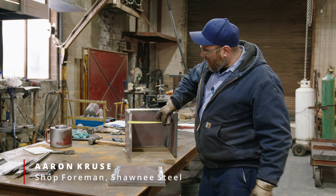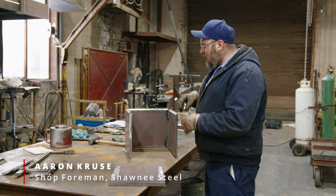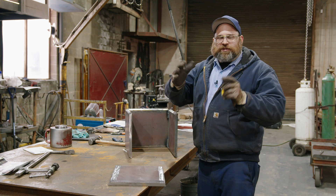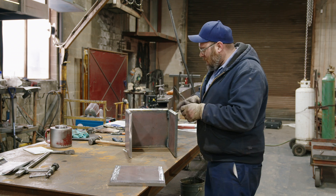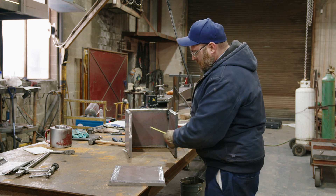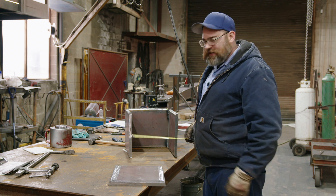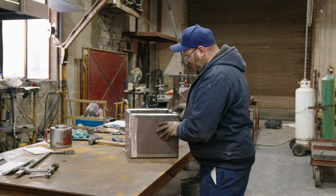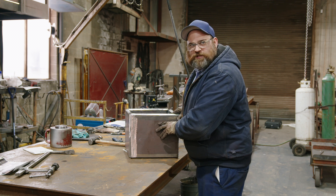What I have here is some three-quarter plate — it's a box. I've welded it down and it has shrunk in on me, and I need to widen it out. Right now I'm 12 and a quarter on the inside here, and 11 and three-quarters on the inside there. I need to push that out in order to weld this on in the correct spot for spacing.